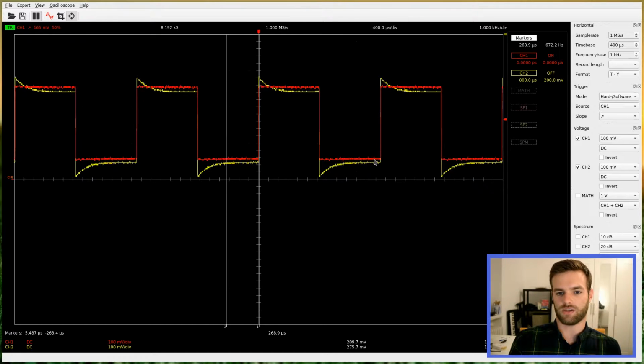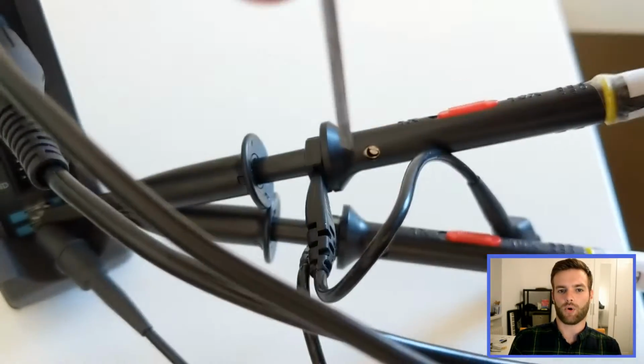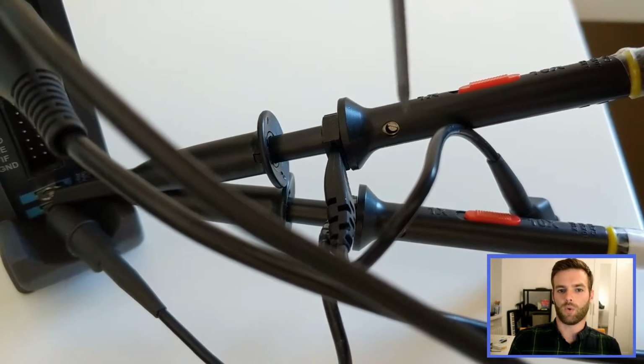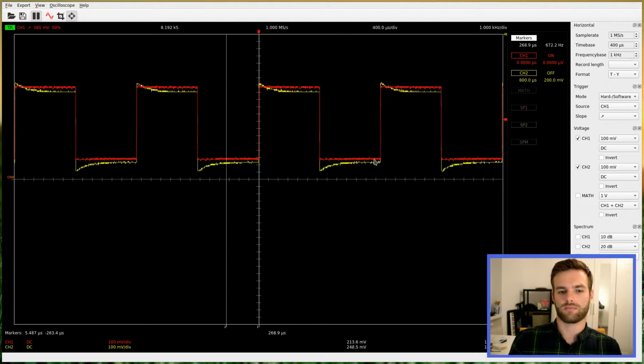Now I activate channel 2. As we can see, channel 2 requires some calibration, as the pulse train is not perfectly squared. The probes have 2 screws that allow to adjust and correct this effect. We adjust the screw until the waveform becomes squared.